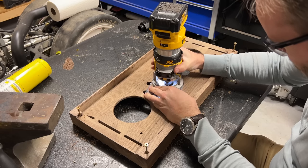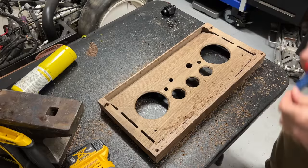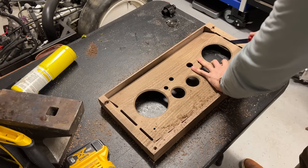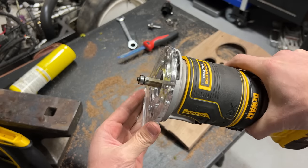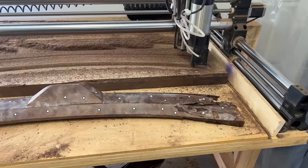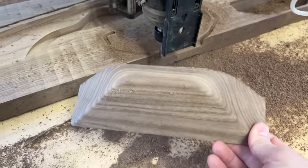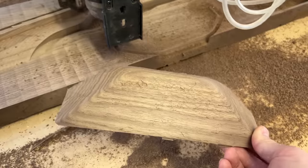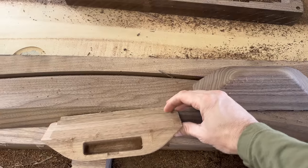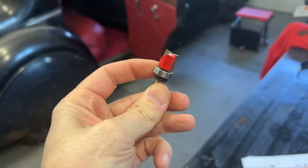This piece came out great. I decided to do the chamfer cuts by hand with my router — I didn't really know how deep I wanted them, so I just did a few passes until it looked good. The wood was held down with four screws in the corners, and I left tabs to keep the final piece constrained. I cut those tabs with a handsaw, then flush-cut them with one of those bearing router bits — flush router bearing bit? I don't know. Next up was the main upper dash piece, cut with a ball nose end mill doing a ton of passes. I cut the ashtray separately, didn't like the wood grain on it, so I redid it in a slightly different orientation and it came out a lot better.